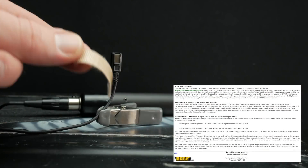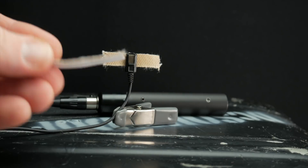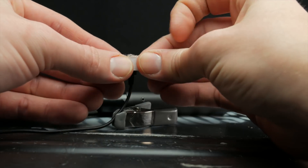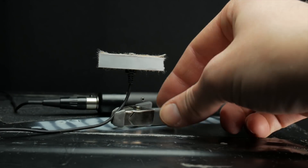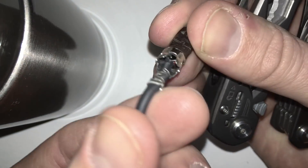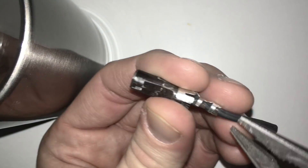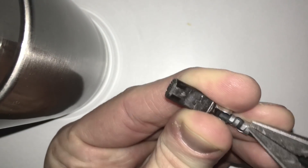If you're not familiar with voltage bias and what it has to do with these microphones, I'll link a great article from thebroadcastshop.com below along with a couple other articles that give you all the details. In short, there is a small voltage required to power these microphones, and various wireless transmitter manufacturers over the years have supplied that voltage differently — either in a positive or a negative bias configuration. Tram makes this microphone in both versions to suit your needs.